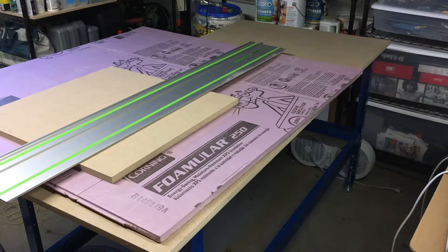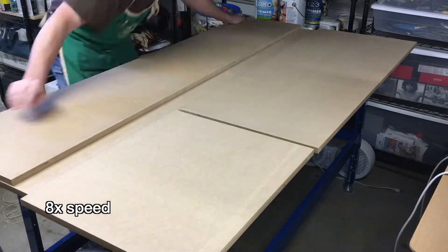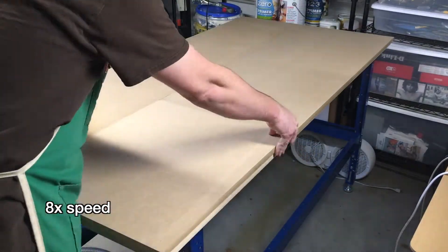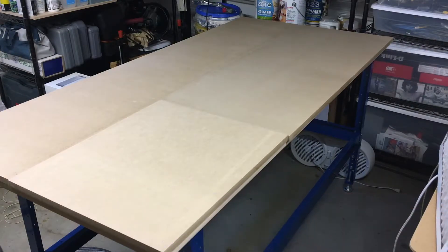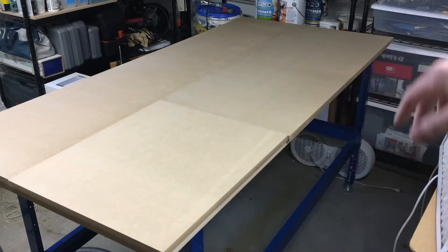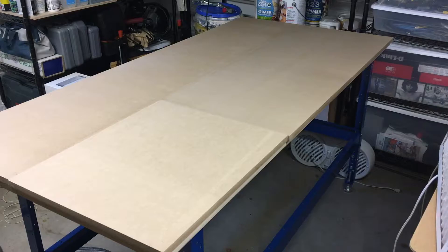I got my cuts made, so I'll clean this up and arrange the parts how I want them to be. I can use a router with a flush trim bit, or I could even take my track saw and just slice the edge off — though that can be a little dusty when you're slicing a small edge like that. I'll figure out which way I'm going to do it later.